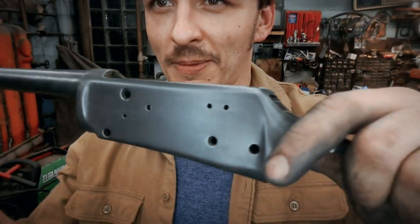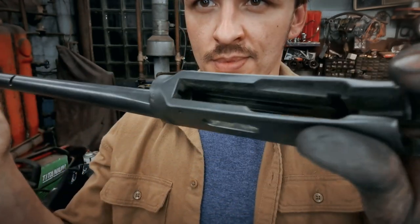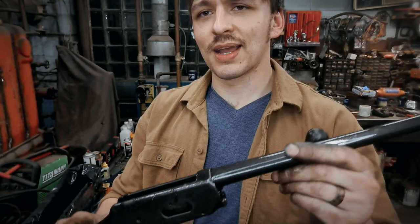It's time for the final kerosene bath. Here's a close-up of what it looks like before being dumped — unbelievable compared to how it was. It's going to get about four shades darker as soon as we dip it in some oil. You want to use kerosene because it draws out any moisture that may be left over on the steel. If it rusts after this point you might have problems with your finish later — it will always be there like a blem. Let it cure in kerosene for about two days, then you can assemble it and get it covered in some good oil.